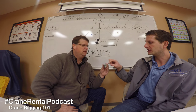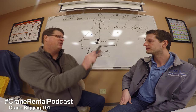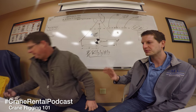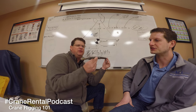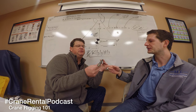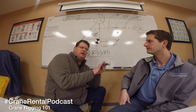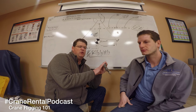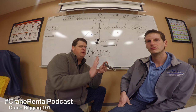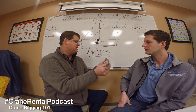There's a measurement process when you inspect and they call it one lay - so many little broken wires or defects within one lay is how you determine serviceability. A lay is from top to top of one strand - that distance is a lay. That's why it's painted blue, so you can visually see it. There is some allowable broken wire count, but we can go through each specification in detail another time, since it gets complex.